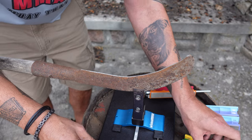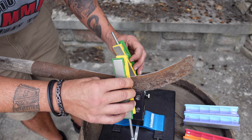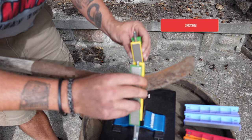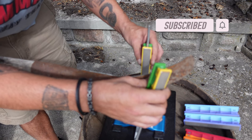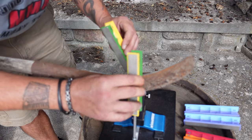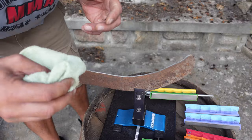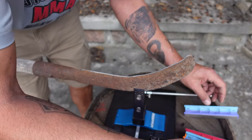Let's switch over to the 400 grit — slowly and carefully is the recipe of the day. Feeling pretty smooth there, definitely have an edge, feeling some sharpness, which is a great sign. There are still some imperfections, but I don't want to work off too much metal. I'll go ahead and switch over to the 600 grit stones. There's definitely a working edge on there now. I'm going to give some passes with the 800 and then finish up with the 1000.